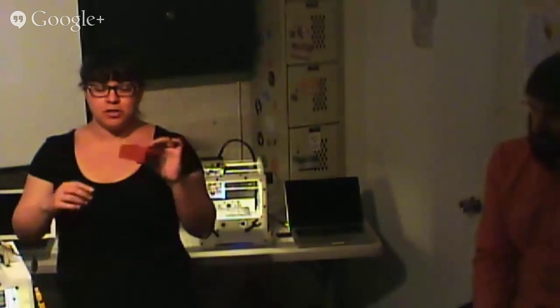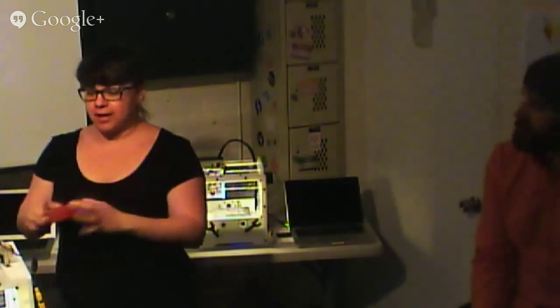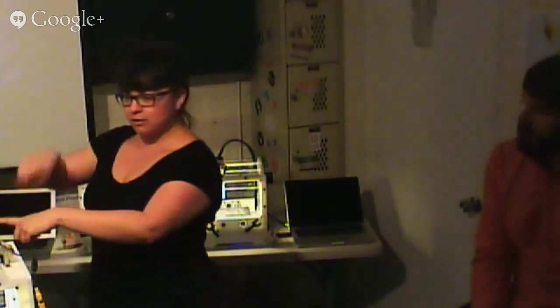Okay, so polycarbonate? You can do polycarbonate. That would be fine. You'd have to kind of play with the settings a lot because one of the things about machining is that there are a lot of variables involved. A phrase you hear a lot in functional machining is speeds and feeds, which means the rate that the spindle spins in relationship to how far the bed moves and how fast. And then you have the software which keeps track of all the settings for all the material. For example, if you have something that's this thick, you need to tell the machine that it's this thick, it's made of machining wax, and these are the dimensions X and Y. X and Y are the flat plane of the bed, and then, of course, the Z is the up and down. So then you can just save your settings for the next time.